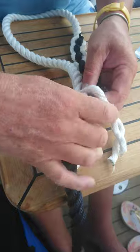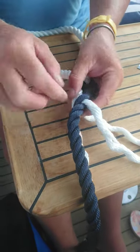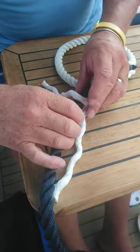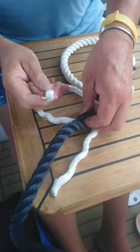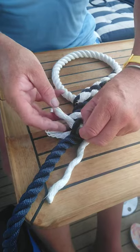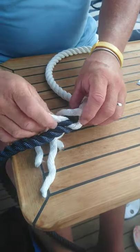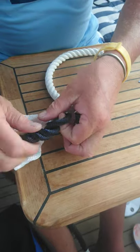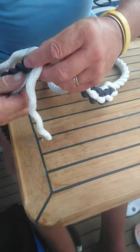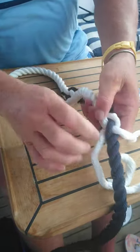So we should have three strands now. With the three laid in like this, the important bit is to get this first bit right — if you get it wrong it always looks a mess. Fold the two ropes together and you'll see it starts to become obvious that one wants to go on top, so it's top to top. Turn it round — this one wants to come in under here, back on itself, and it's important it goes in the rope that's opposite. Bring that one in there, and then the last one goes into the one that hasn't got one.